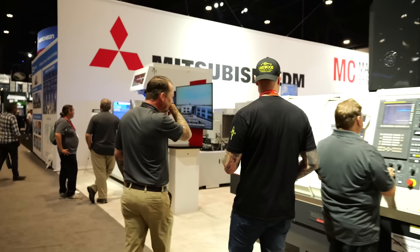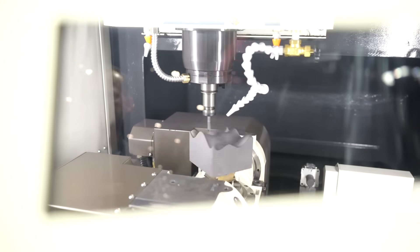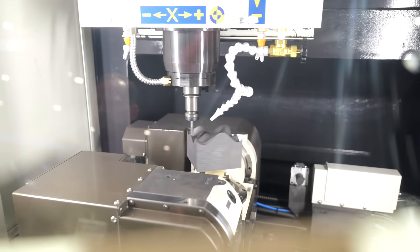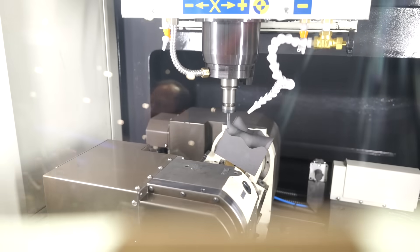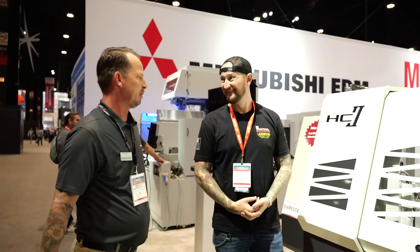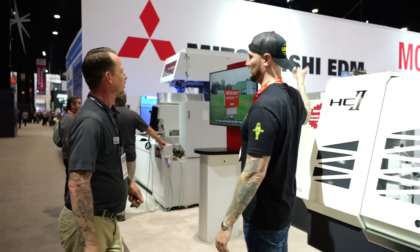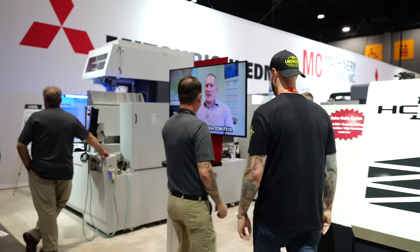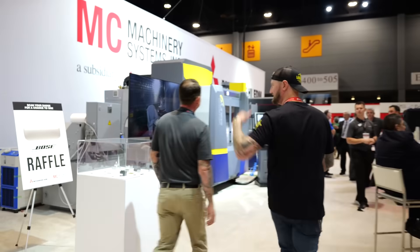Let's take a look at what's actually doing the milling on there. That looks like a little 5-axis trunnion on there. Yep, we have a B-axis set up on here — nice for doing multi-axis electrode work. This machine is our Roku Roku with a 32,000 RPM spindle, completely sealed bearings, all ways completely sealed, and it exchanges the air in there six times a minute. That's important because graphite is a very nice material but you don't want to breathe it in. Not only that — it creates a lapping compound for your ball screws and will wear them out pretty quickly.